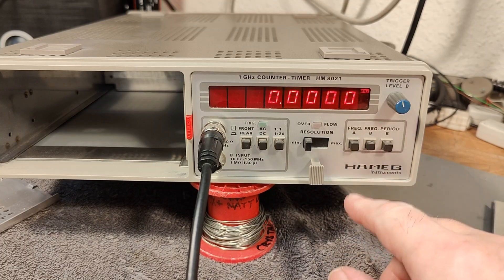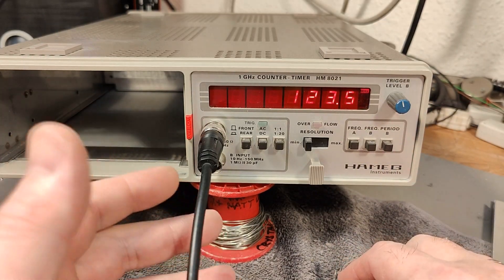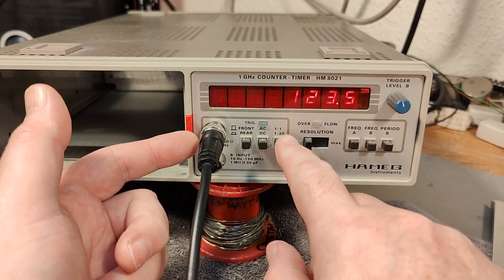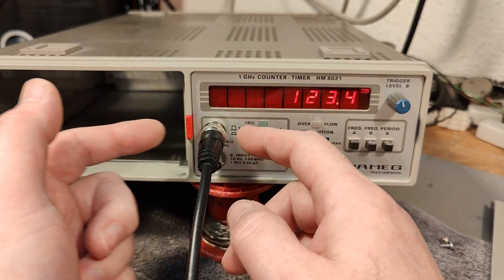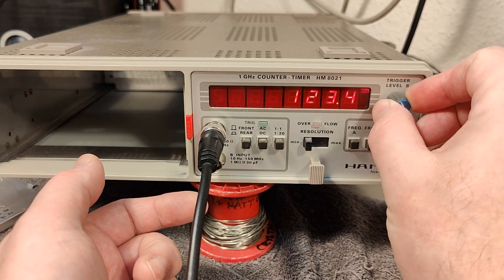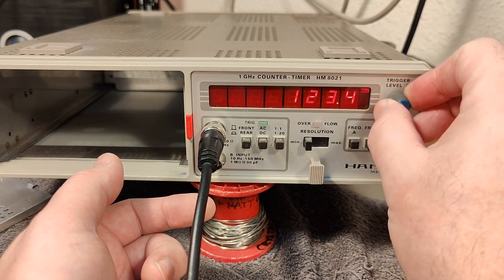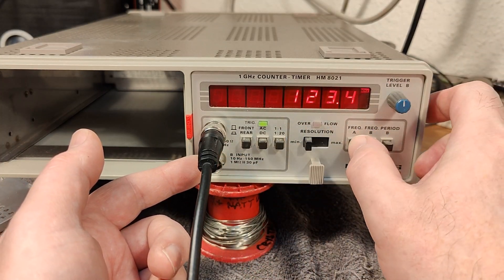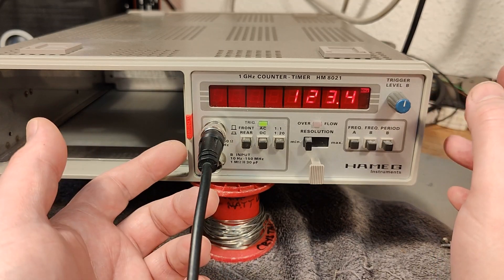It is working on input A and input B. Everything is now much more stable after I poked around with all the wires and plugged in all the ICs correctly. The thing with A input is — if you select A input, all the trigger circuitry is no longer relevant. It just goes straight through to the connector, and then the prescaler output goes to the entire counter system. That also means the trigger button here is not doing anything when in A mode — this is always connected to B, and it even says 'Trigger B' on the front. So trigger B is still working even if you have selected frequency A. This is 123 MHz.